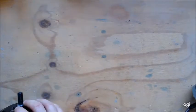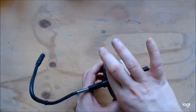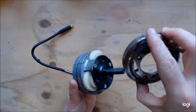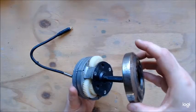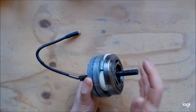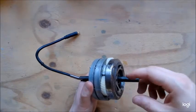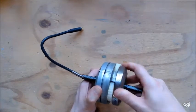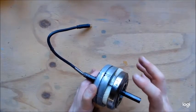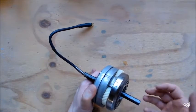Besides the Q85s, you have the brushless motor here, which goes via a planetary gearbox to a gear that we weld or shim shut, and then that's attached to the outer surround of the motor. As the motor drives, it drives the planetary gearbox which drives the outside. So it's a planetary gearbox with a motor in the middle. These are very efficient and also very powerful — when they turn, you just can't hold them due to the amount of power. If you imagine these taking a 70-kilo person from stationary, you can see the power involved.